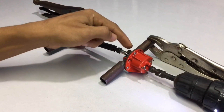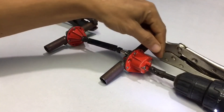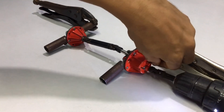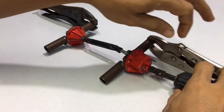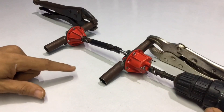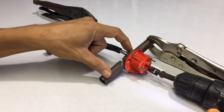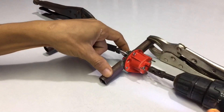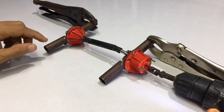Now I will connect the end axle and I will disconnect the middle axle. Remember to look at the end axle together. Now take a look at where I point — I will pull it forward. Now I have pulled it forward, and the end axle is also working. Take a look at the middle axle — it is already disconnected. We must also note that the middle axle, as well as the end axle, must not be jammed, but should move normally with the push and pull of the end axle.